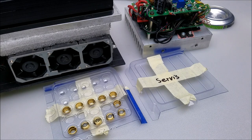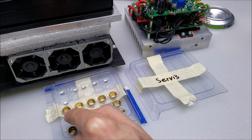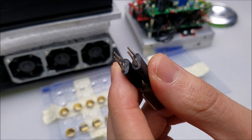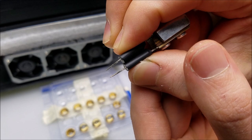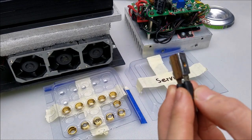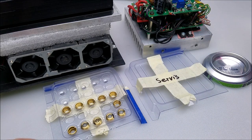Now let's start with the delicate task of mounting lenses into carriers. There are four lenses I need to mount, which will give me two extra. Here are my lenses and here are my carriers. To help with this task, I made myself a little lens tweezers — a very handy tool that has four prongs so the lens can't go flying. Got the epoxy here, and now we're going to mix the hardener with the epoxy.